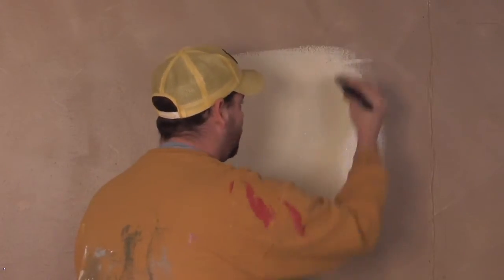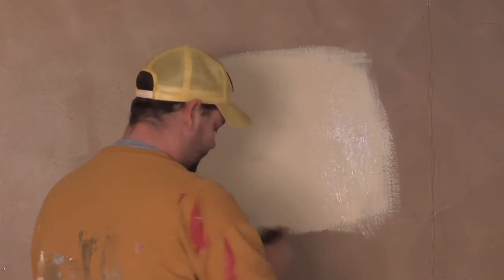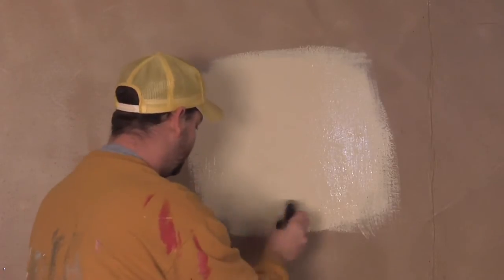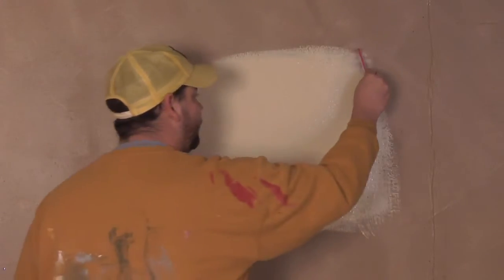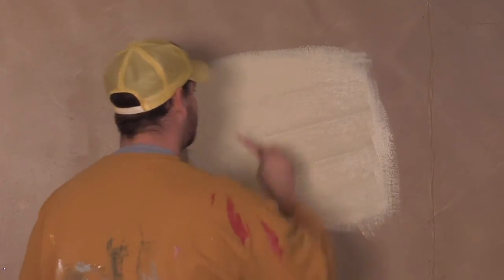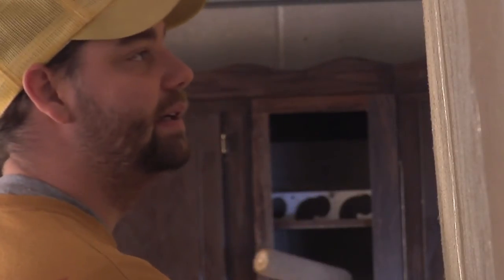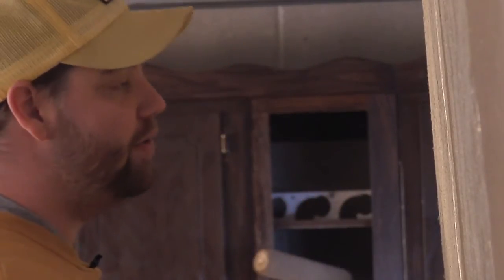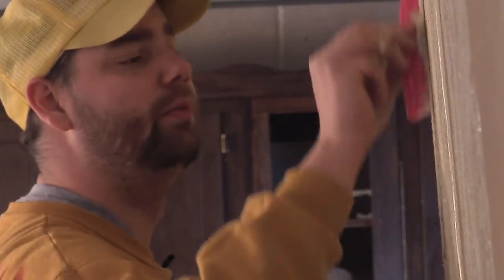Make sure you've got lots and lots of paint on this wall. And then after you've got it kind of surfaced, you might want to go over it one more time, just add a little bit more paint on there. Then after we do that, you're going to take your comb and drag it through the paint. What's really important to note when you're doing the combing technique is that you're going to want to do it immediately after you paint, because if you don't do it immediately, you're just going to be peeling off big chunks of paint — more like a paint scraper than a comb. You want to get it while it's nice and wet, not when it's clumping together.